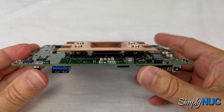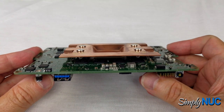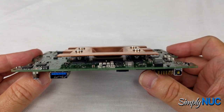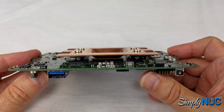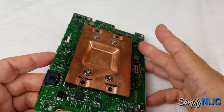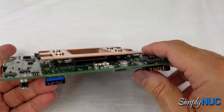Underneath the power supply components you can see the DRAM. This unit has 4GB of DRAM soldered down. Most customers would typically request only one to two gigs, but with today's DRAM pricing, it's actually cheaper to solder four gigs down rather than one or two and offer a single SKU. It is dual-channel, so you get high memory performance.